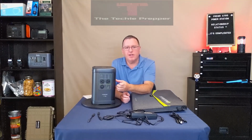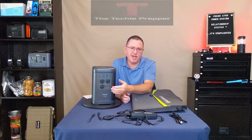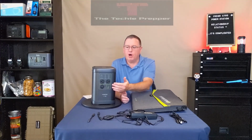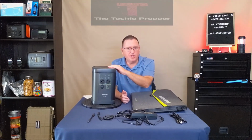So everything worked as it should, with one caveat, and I'll show you the details on that in a minute. But the capacity checked out on the AC side. I ran the test several times on the AC and DC, and the capacity on the AC side was about 85%, which is industry standard. That's what you'd expect. DC was in the mid-90s, and that's what you'd expect from the DC side. All the ports, input and output, worked no problems. The display had no issues.